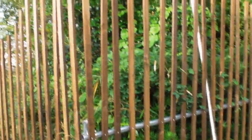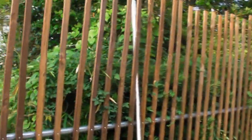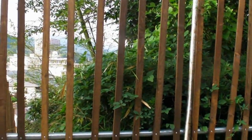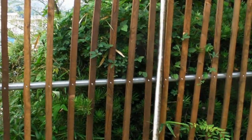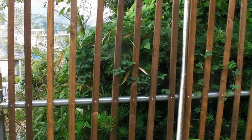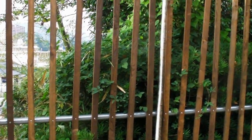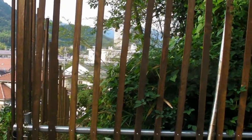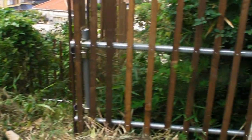The poles are very durable. The important thing with wooden fences is to use no horizontal wood, because horizontal wood rots — water stays on it — whereas vertical wood does not rot very quickly at all. So we bought cheap poles, 21 millimetres by 45 millimetres by two metres, and painted them with a modern equivalent of creosote.